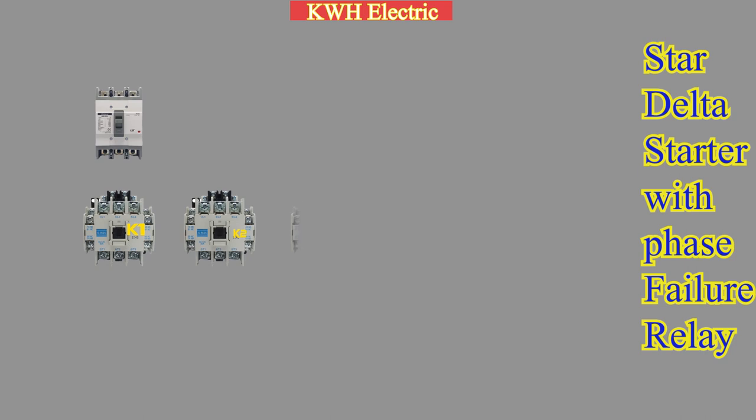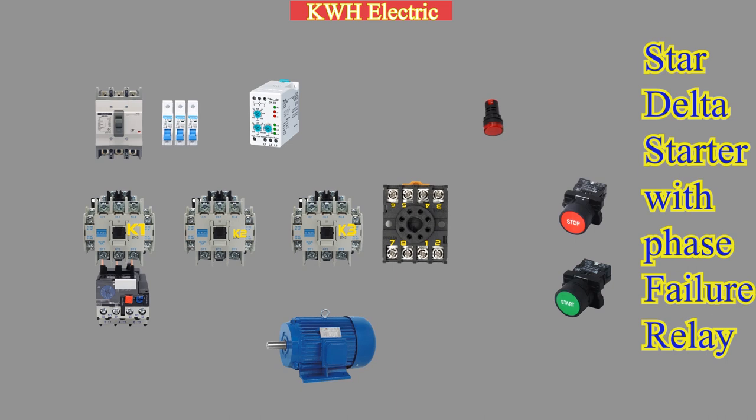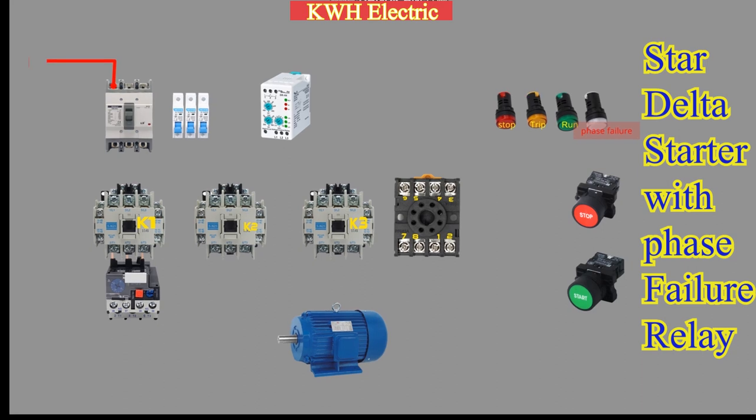In this Star Delta starter, the components used include an MCCB, molded case circuit breaker, 3 contactors named main contactor K1, delta contactor K2, and star contactor K3, overload relays, a timer, a motor, 3 single-phase MCBs, miniature circuit breakers, phase failure relay, start and stop push buttons, and stop, trip, run, and phase failure indicators. These components are used to control a 3-phase induction motor.